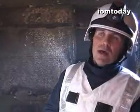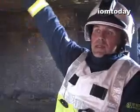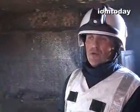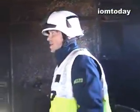The temperature in the sprinkler property reached 81 degrees at the ceiling and then came down to 20 degrees. In here, we'd be close to 1,000 degrees centigrade. What happens is the fire comes across the top, heat transfers down through the room, and anything underneath — as you'll see in the video of the presentation — basically pyrolyses: it melts, gives off fumes, and the fumes are fuel. Everything comes down and it's totally involved.